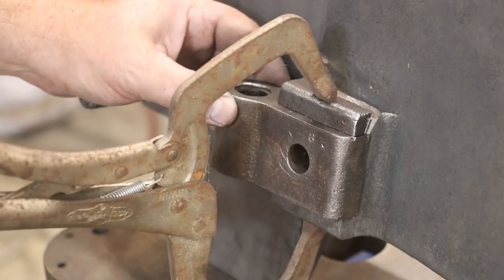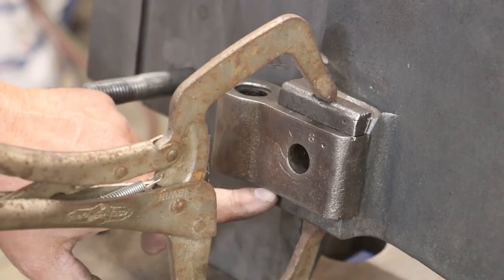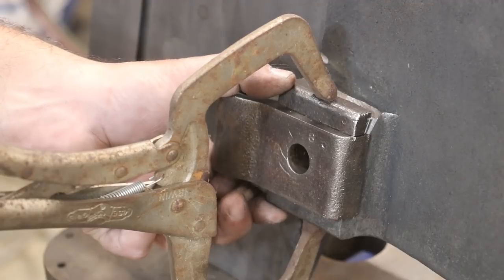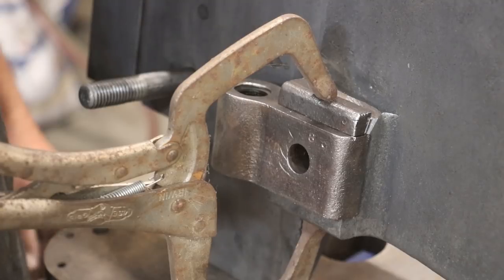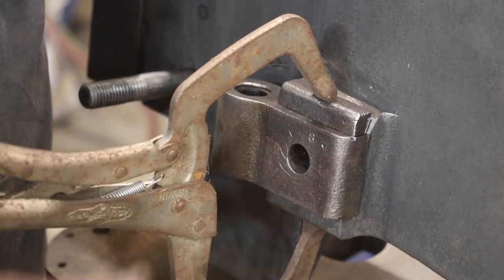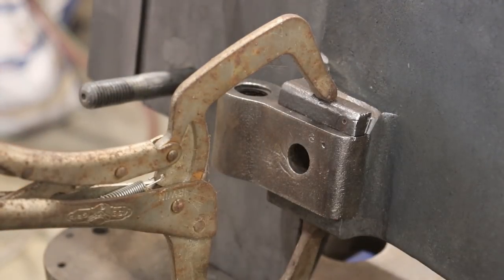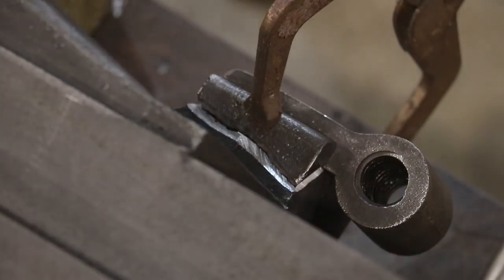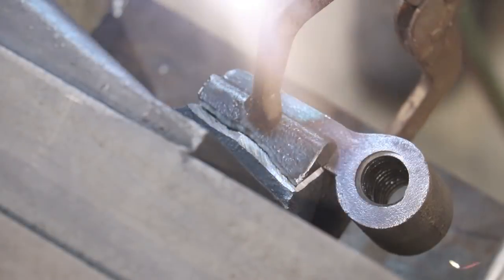I've shown you the setup — I put the piece that fits into the slot in there and put a little shim underneath the bottom. There's a four-thousandth-inch thick shim in there so that when we unclamp this, that part will come in and out without any problem with enough clearance. I used a set of Vise-Grips and clamped it all firmly in place for brazing. You can see I've beveled out all the way around that piece of metal, which gives an area for the braze to go down in. You want it very clean with a nice V'd-out area for the braze.